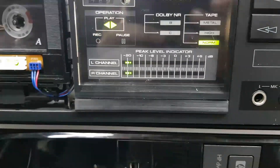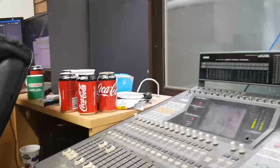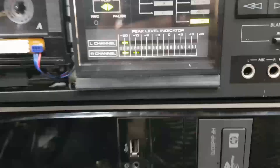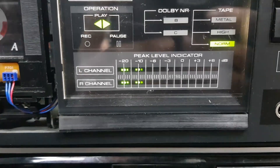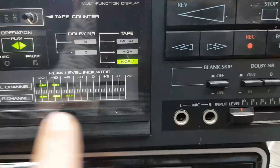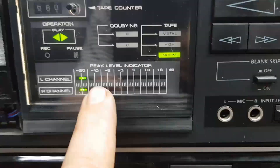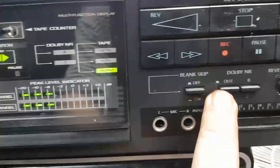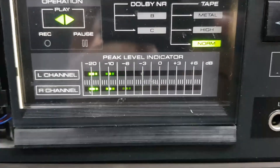I'm getting there. You can see already it's down, which is good. I might be able to play a little bit of this — this is the track I used. And you can see the output on the Yamaha is not that bad either. As I said, this track's almost totally mono. But it's a hell of a lot lower. This track on playing is recorded with no Dolby. It appears as though with this one the Dolby does not affect the PPM. Some cassette decks, if you engage Dolby, you'd see this drop off, but this one seems to process before it gets to the Dolby. But you can see — it's just hitting zero now, which is where it should be.